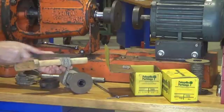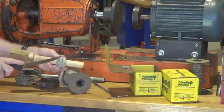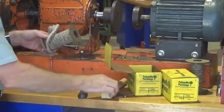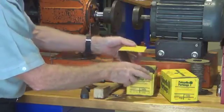We do a nice straight cut. For a pump we want a straight cut. For valves, 45 degrees like that. A good sharp packing knife is required so you get a nice neat cut on the ends of the packing rounds.